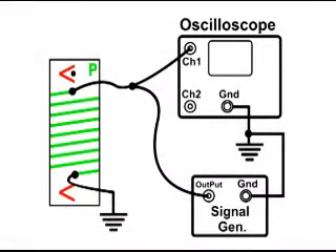This is the setup for the primary coil. At the top of the coil, where the arrow and dot is, that wire goes over to channel one of the oscilloscope and also down to the output of the signal generator. At the bottom of the coil it goes to ground, and that ground is also the ground of the signal generator and of the oscilloscope.